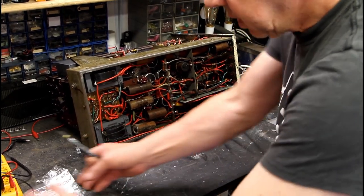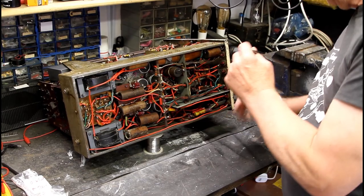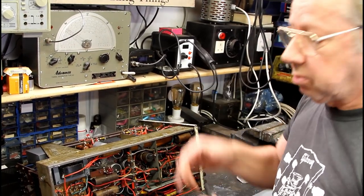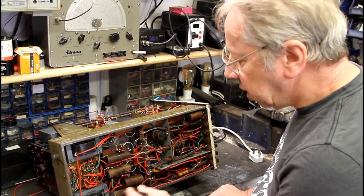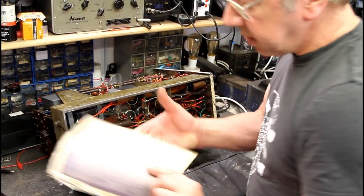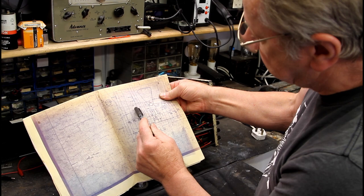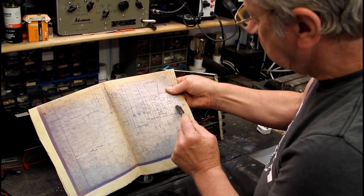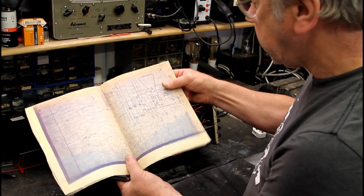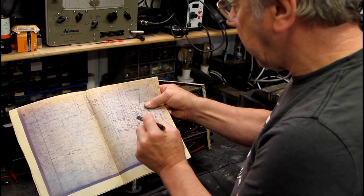It's a new day. We've got some bits and bobs - replacement caps for this Cosor scope. I haven't got around to replacing all of them yet. When I switched it on via the variac all I could get was a blur on the screen - there's no time base, it wasn't focusing. So I thought the best place to start is the high tension supplies which feed the tube, which is a negative supply on this one. There's a potential divider for the focus control and the brightness control. C35, which goes to anode 2 and anode 3, was open circuit, so I replaced that.